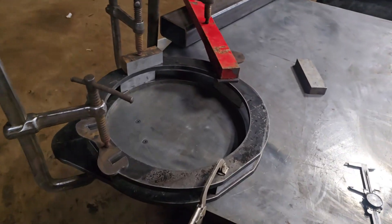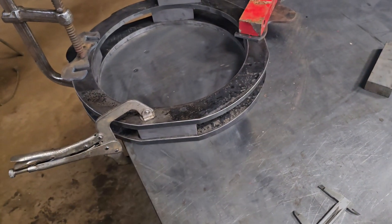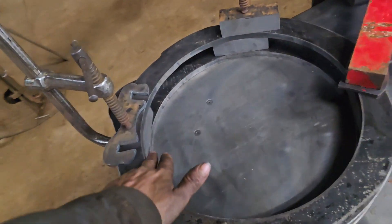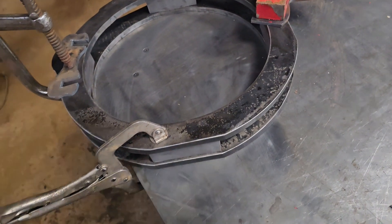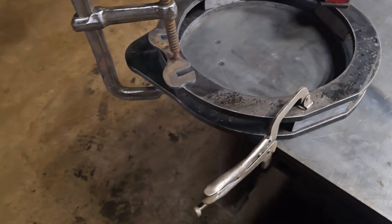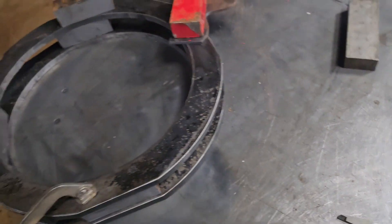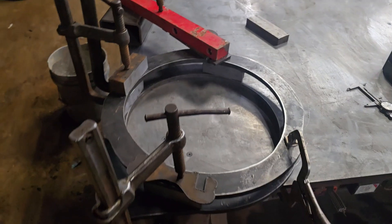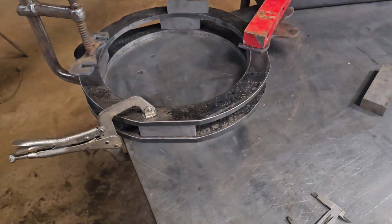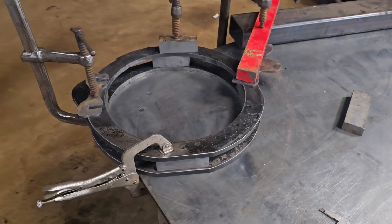This is the clamping arrangement I came up with to secure the weldment and try to minimize warpage. To make up the gap I added some little blocks cut out of mild steel bar — inch and a half — so yeah, we're going to weld this up. We may make pieces to go over here on the sides; might not really need it, but probably wouldn't be a bad idea. I could TIG weld it, but I'm probably just going to MIG weld it. I don't think it really needs to be TIG welded — it's just going into the yard crane.